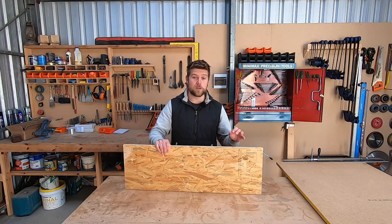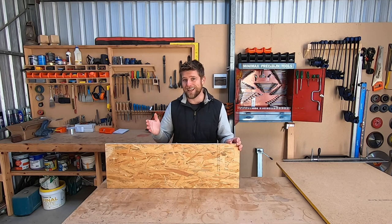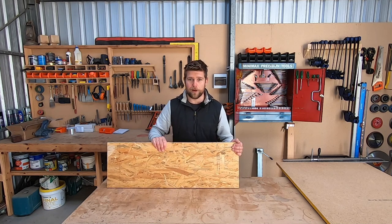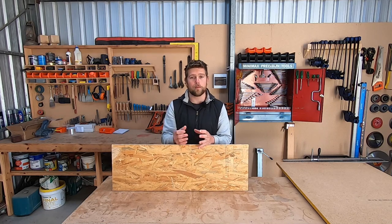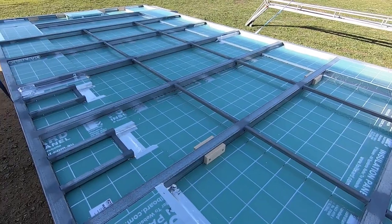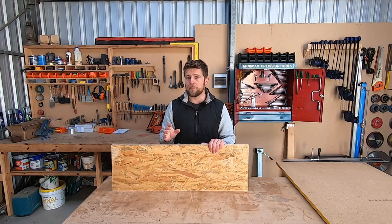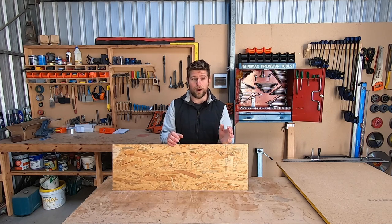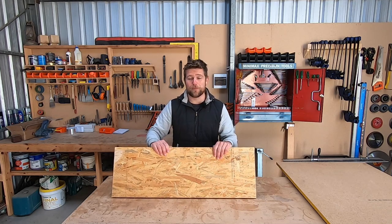The product I've gone with is OSB flooring — the lightest option and really cost-effective. This is 18mm OSB, which is only rated for a maximum 450mm center spacing, and my trailer has 600mm ribs. While we don't have to comply with building code, it's a good measure of performance. I realized I could brace between the ribs in areas with point loads or high-traffic walkways to support the floor, and the result is really stiff and solid. Going with 18mm instead of 22mm OSB saved me 60 kilos — already counting towards my planned hardwood floor at 200 kilos.